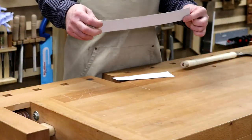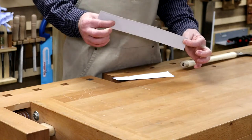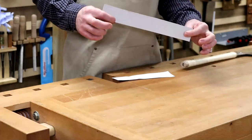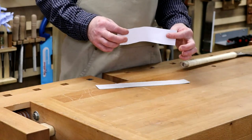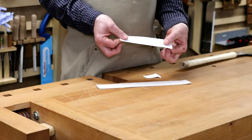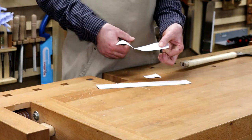Western saw, something thicker. This is cardboard. So to be able to push it, it needs something stiffer to push it through without it buckling too easily. Right, so this is quite stiff. You can see I can cut thin bit of paper. But a Japanese saw, do you have any cuts pulling towards you? Pulls everything nice and straight. So when you're cutting, you get a nice straight line.